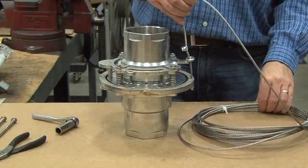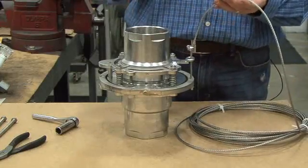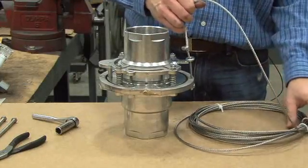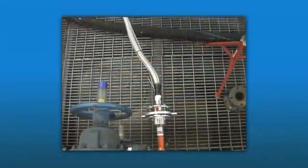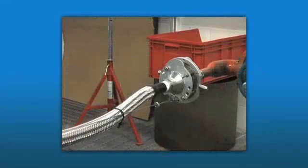The unit itself is made up of two coupler halves, held together by four segments and a slide ring. The cable moves the slide ring, which results in a release of the holding sections and a separation of the two coupler halves.